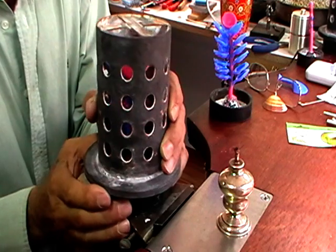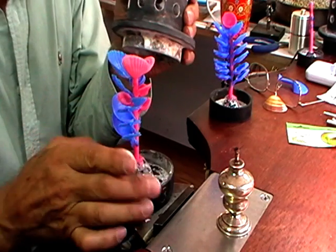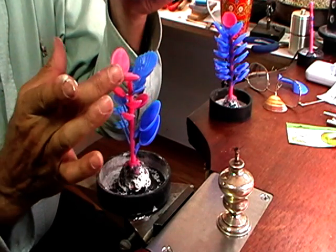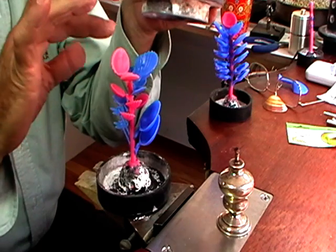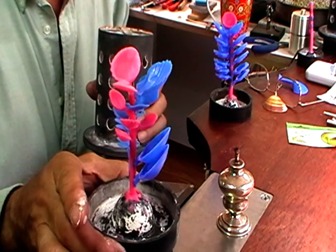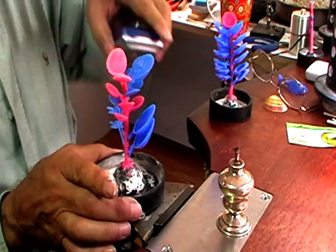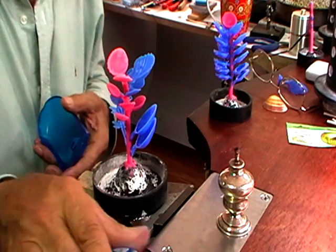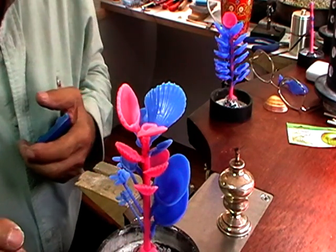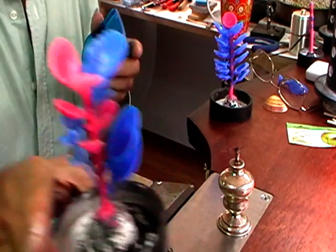When you've finished making your tree, they call it that because it does look like the branches on a tree. So these are all individual waxes. You slide your casting flask over, have a look to make sure that you have the clearance, 6 mil on the side, 13 from the top. Now you have to weigh it with your waxes on there. So we know the weight of the base. So with the waxes is 117 grams. So we'll also write that on the base.